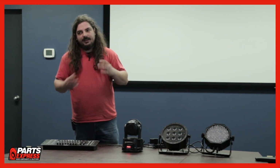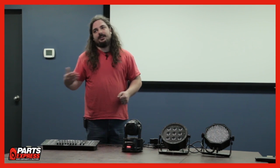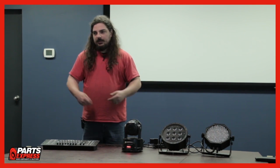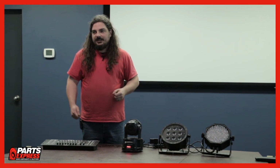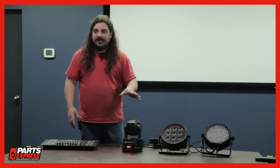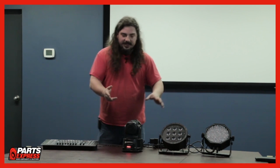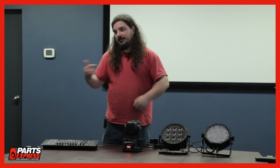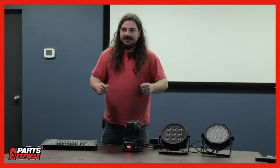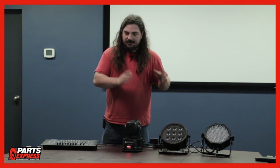As soon as you start getting to like 10 lights or more, then you'll run into problems. If you have to run 50 feet or more, you'll get into problems. So short runs, only a few lights, you could absolutely use mic cable. It's not going to harm anything. But as soon as you start hooking up more, they will start wigging out. You'll have one of them, doesn't even have to be the last one, doesn't have to be the first one, but some point in the line, one of them will start flashing, start doing crazy stuff that you're not telling it to do.